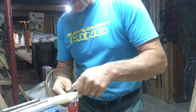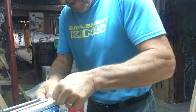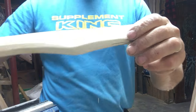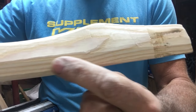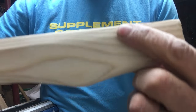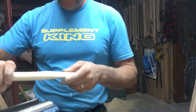Take some off here where we know it was going to curl and cause a weak point — that's gone. There's a little rough spot here, so staying on that octagonal angle I'll rasp it in. That continues right smoothly into here. Same thing at the front — flat — and I'll round the very edge so it slips into the axe head. Same octagonal angle at the back and bring that right in. Now that's a nice smooth transition. Take your sandpaper and finish sand it.